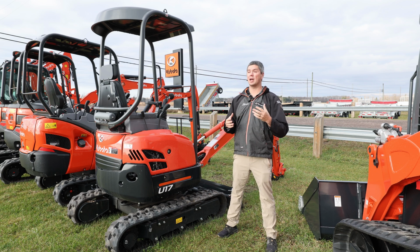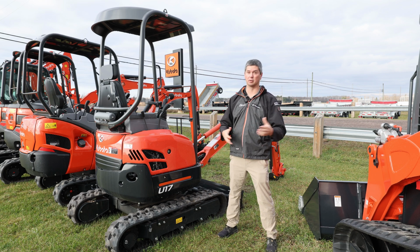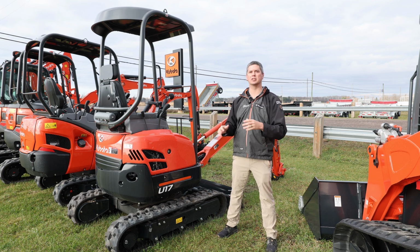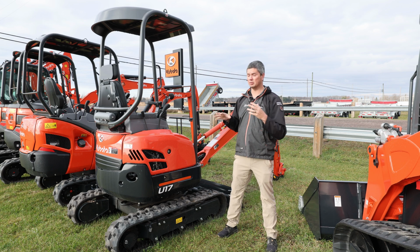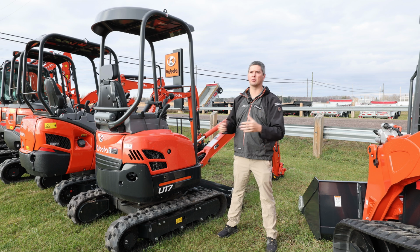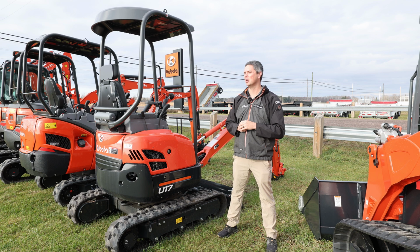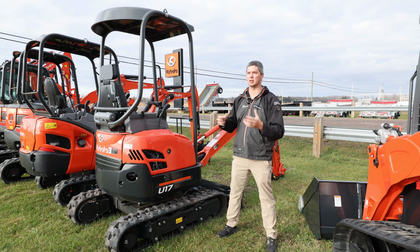At that point, you're going to need a tandem. There's somebody out there going to say, well, I could put an oversized load on this. Yeah, theoretically, you could. But realistically, you're going to be looking at a tandem trailer to take that capacity. You're like, well, it's very small, why do I need that? Well, that's what you need legally. There's no doubt about it. Just to get on the road legally, you're going to need a small tandem trailer, because you're going to be towing around 6,000 pounds: 4,000 with this, and then 2,000 pounds with the trailer weight.